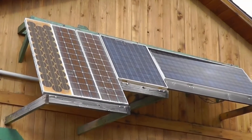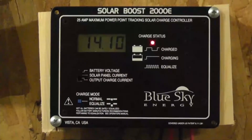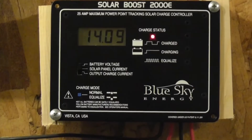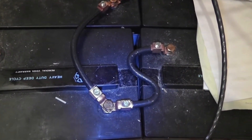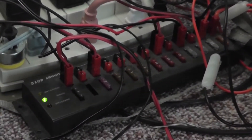If you've got a 12-volt station, it's nice to have some other source of power, such as a battery or something like that. I happen to use solar power at my station — you're looking at my solar panels. There's about 250 watts of collection capability there, and those are channeled through this charge controller, which then goes down into very large, sealed, absorbed glass mat lead-acid batteries, which are very heavy and very expensive, but I've had them for a long time and they've served me very well. I have a small repeater battery and a power distribution system at my station, and coming off of all of these are the cords for the various 12-volt things in my shack. These connectors are kind of standard nowadays, so you'll find a lot of power supplies are already set up with these on them.